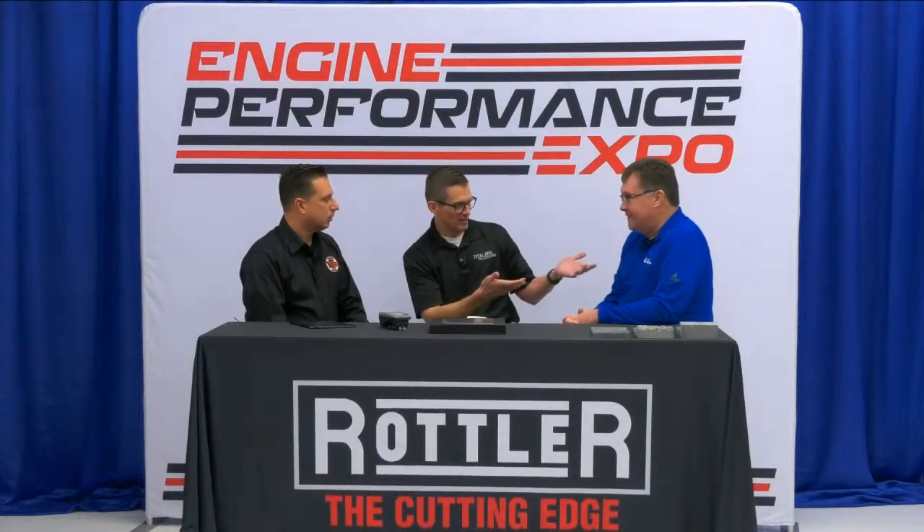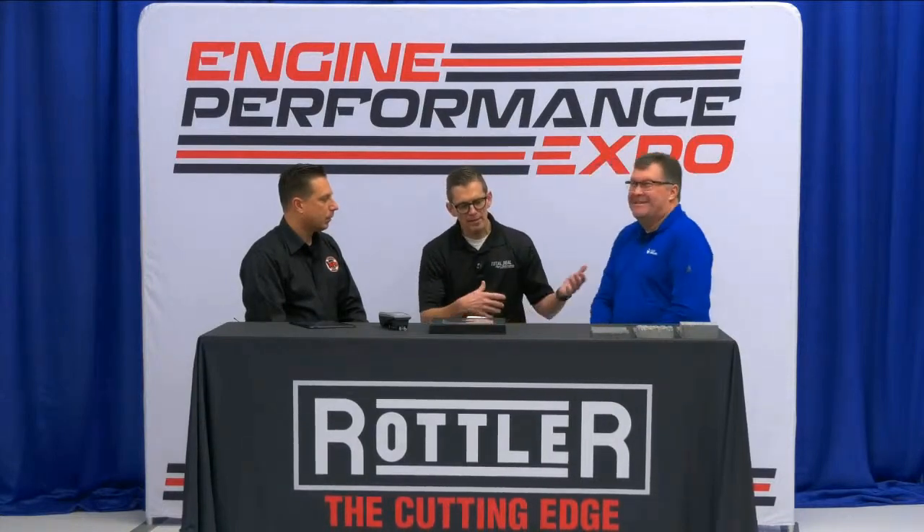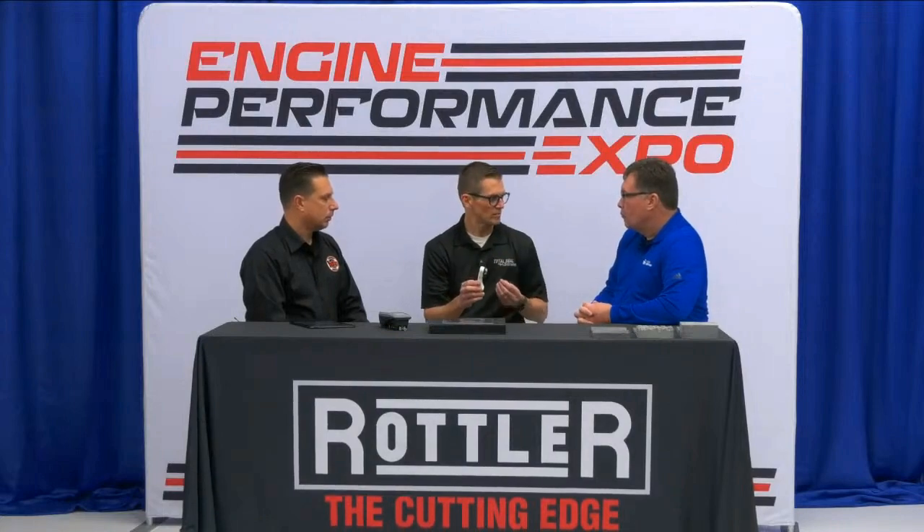You've been using this longer than I have — you kind of brought it to us, so thank you Mark for doing that. Talk a little bit about how this changes how we see what we've been doing. I think that's been the case with honing across the board — we've been honing until things feel right and we've got the right size, but we really haven't applied any craftsmanship to it. It's push a button, get a number of strokes, and move on. And now we're seeing inside and we're able to control things better. Whether it's crosshatch or material integrity or scuffs, having eyes in the bore along with this knowledge we're connecting to engine performance has been huge.